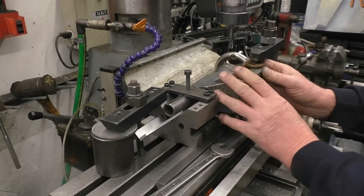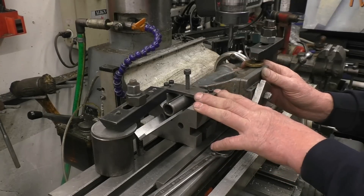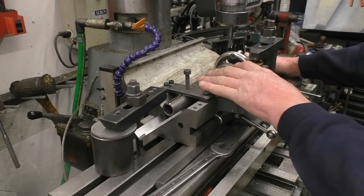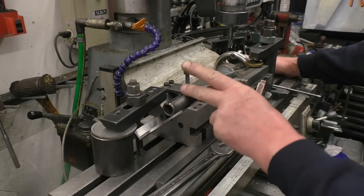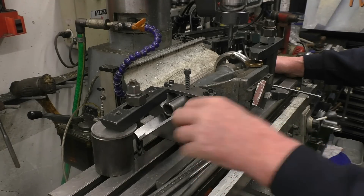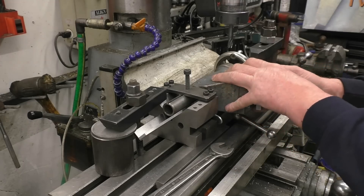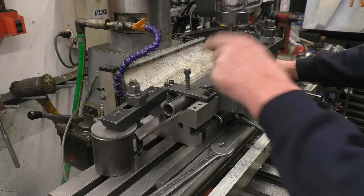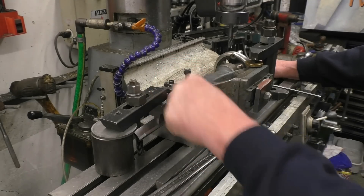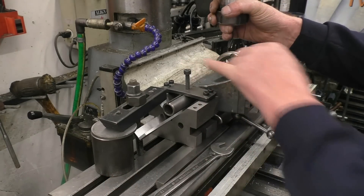If you want to see them earlier you'll have to look on the parent channel - the link as usual is in the description box. This is my Myford ML7 lathe tailstock - it's off the same lathe I've just done the cross slide for. The lad has bought the three-axis DRO for it and wants to make a flat on there so you can mount the DRO scale onto it. I've basically used the spindle nose to mount it - I've got it in a V-block up against a bit of 14 mil case steel, I've got a square on there and it's lying nice and level. I've got a clamp on the back, so I'm just going to machine a flat on there with a big milling cutter, and then he can drill and tap it wherever he wants for his scale.